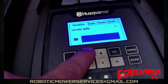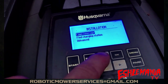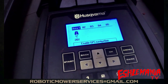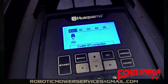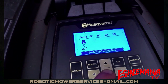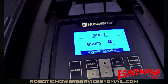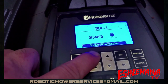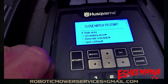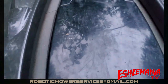To save that, just hit the Back button and get back out of there, then go into Lawn Coverage. We were using Area 2 to test — whichever area you're using, you want to set everything back there as well. If you're using GPS navigation, come back down, highlight Enable Navigation, and hit OK. Now you're using GPS navigation. Go back out of that to your menu screen — it's saved. Hit Start, Main Area, OK, and now the mower's ready to mow again.